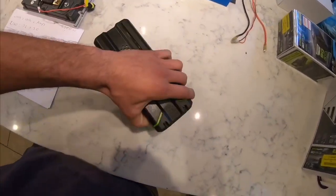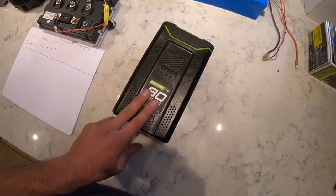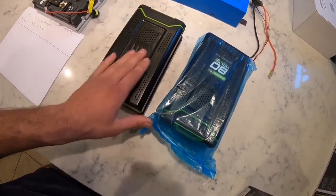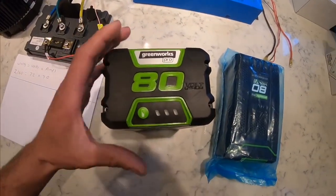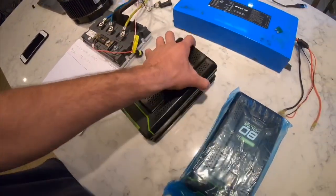These batteries are ones you can go to your local Grainger, Lowe's, or Walmart and buy. They're pretty well-made, hefty, with lithium batteries inside. The coolest part is you can run them in parallel — you keep the 72-volt nominal and run multiples of these batteries. I ordered two so far and I'm going to order six in total. They're all 5 amp-hours each, but more importantly, one single battery has a max amp draw of 40 amps. I know that because I took one apart and saw the 40-amp fuse in the back.